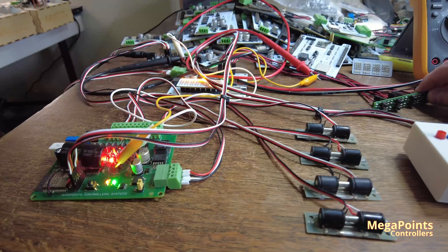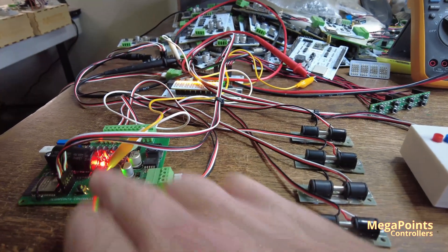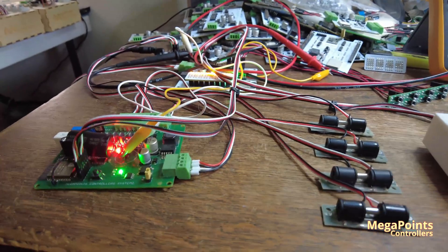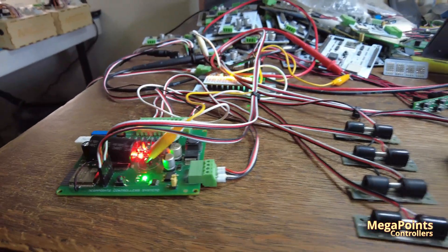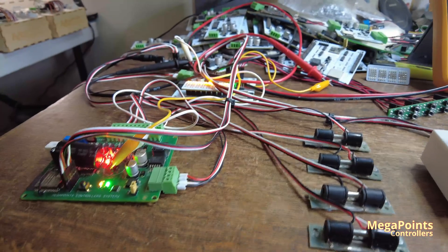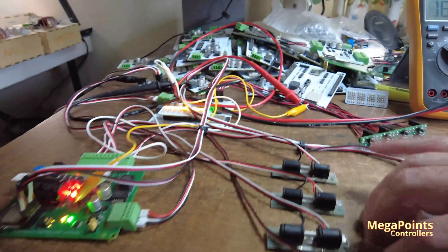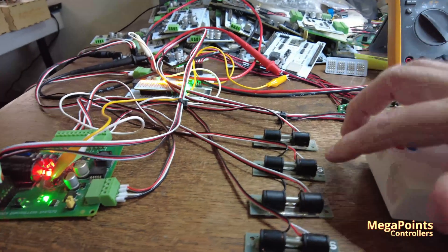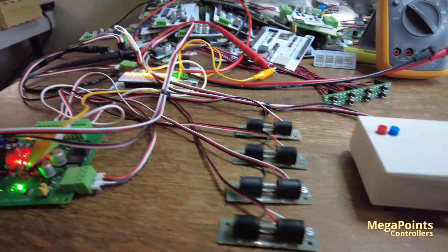What happens is, you see the red light on the solenoid board? It's flickering on and off — that shows when the capacitor is charged. If the red light's on, the capacitor is charged; you shouldn't move the board or plug anything in, because there's a dangerous current there. As you disconnect it, it will discharge over about 12 seconds and that light will go, so you're free to plug things in and out. We've added a FIFO queue so that when all these are instructed to fire, they will only fire if the capacitor is up to a normal charge.